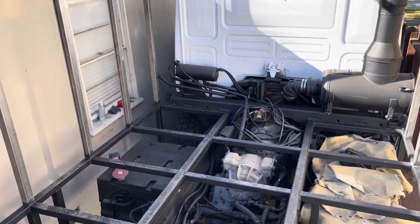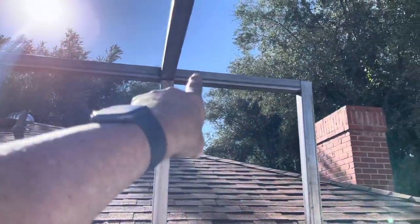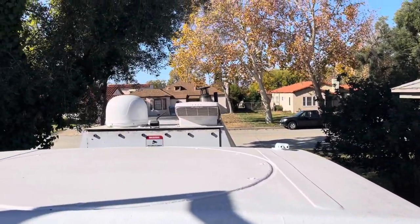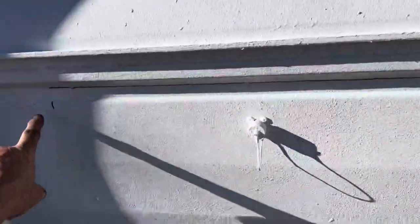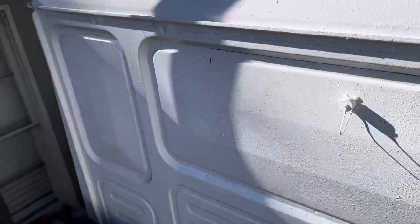As I walk across this stuff — up front from about this point right here down, I'm going to make it do a slight angle. A little bit for aerodynamics, a lot for looks. From being inside here, I'm going to cut up into this drip rail area and then down for the pass-through. That's probably going to be about 28 inches wide, maybe not even that wide. I'll measure my shoulders and see. The less the better — less to see, less to worry about. That's pretty much where that cut is going to be.